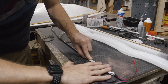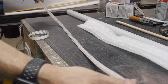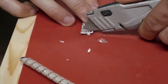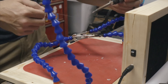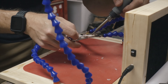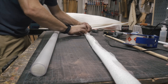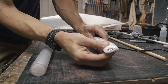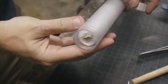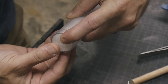I took my two LED strips, peeled off the adhesive backing, and stuck them together end to end. These were longer than I needed, so I waited until they were stuck together and cut them to the same length. I used a knife to take off some of the waterproofing material to expose the terminals on the end of both pieces, then pushed the terminals back to back and soldered them together. I did plug those in to make sure they still worked after cutting and re-soldering. Then I folded the LEDs up inside the material and used some packing tape to wrap it around. I slid this all the way down to the end of the blade, then used the transparent cap with a little bit of CA glue to finish it off.